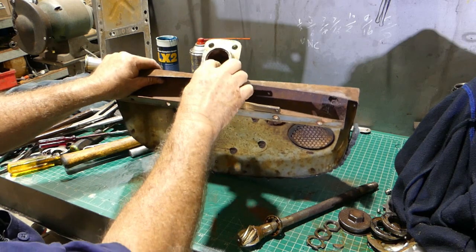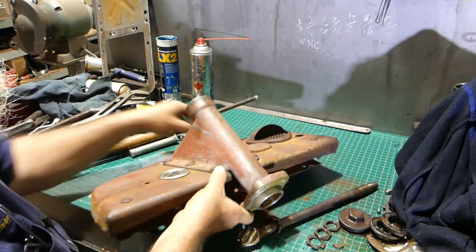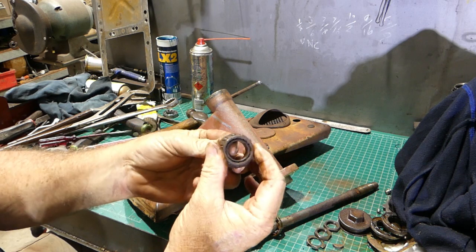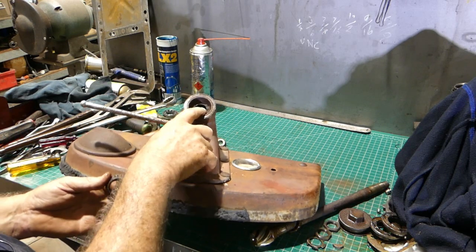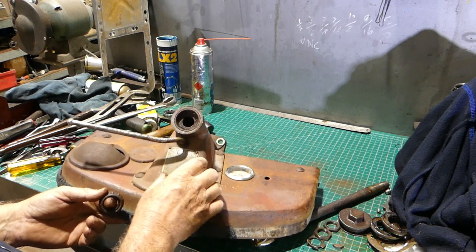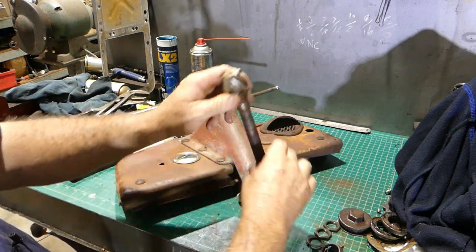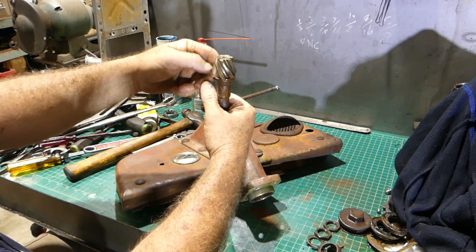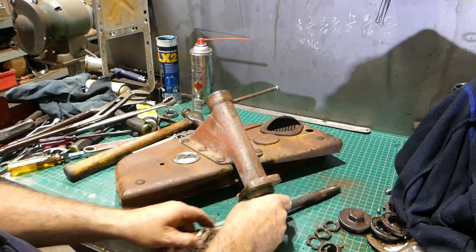What we need to do is get in here with a long punch and pop the bearing out. That's the top bearing — that's the inner — and that's why it was getting a little bit gritty. The top has a cone and a little tin shield. The tin shield is probably meant to stop water but from my experience with this tractor, it doesn't do that. So I'll put this in the vice and tap down on there. Make sure you've got glasses on.